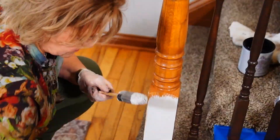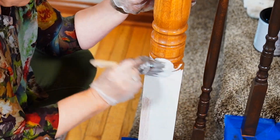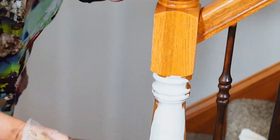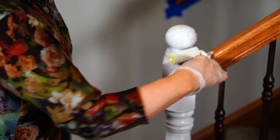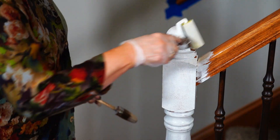I'm going to do brush and roll right on this new post — get on the first coat so you can see how Coliseum is going to look here and the two-tone effect we're going to do. We're using the brush and roll technique to make this process fast and easy. Simply brush on a full coat of paint, then using the dry roller, lightly roll through the wet paint.